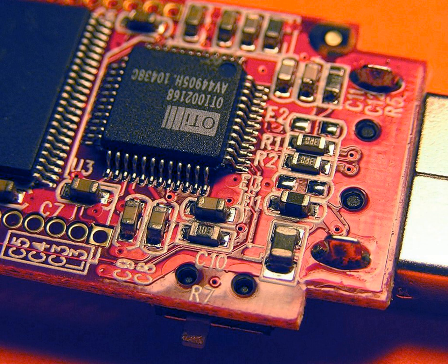Simpler and faster automated assembly. Some placement machines are capable of placing more than 136,000 components per hour. Many SMT parts cost less than equivalent through-hole parts. A surface mount package is favored where a low-profile package is required or the space available to mount the package is limited.